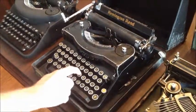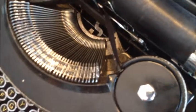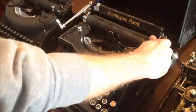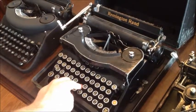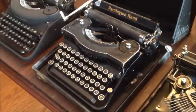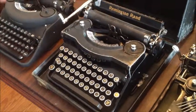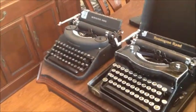All you hear is a slight clack from the platen — these are really quiet for portables. Now the mutant: these are referred to as their quiet mechanism or speed mechanism. Listen — you can hear that this is essentially the same thing but there's no weight on the mechanism on this typewriter. It still requires inertia to get forward, but it's a different feeling. It bounds and rebounds off the platen, and that sound you hear is the type slug physically being stopped by the platen. This machine is a bit of a mutant — the serial number is PT0034. It's really early, possibly a prototype.